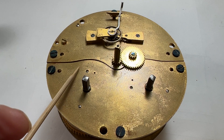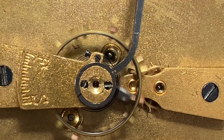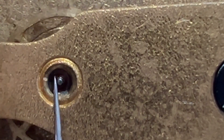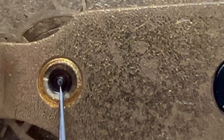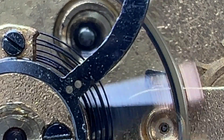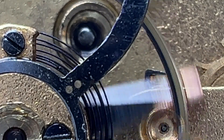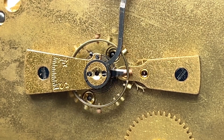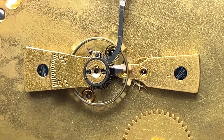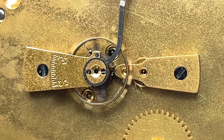Close to 90% of the gold plating is missing on these plates. The balance wheel has poor amplitude — only about 150 degrees, when it should be twice that. The escape wheel pinion is slightly loose fitting, though this wouldn't cause it not to be regulated faster. There is a large amount of excess oil on this pivot, and there's oil on the hairspring. The oil is sticking the hairspring coils together on the outer coils — probably the source for the poor balance amplitude and it running slow. Cleaning the balance spring will probably correct the slow timing, but the excess oil could eventually work its way onto the spring and balance wheel again.